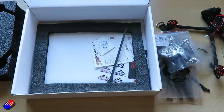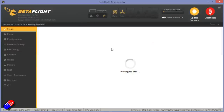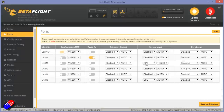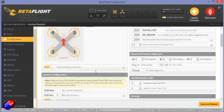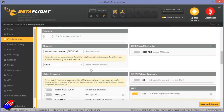Let me quickly go through the Betaflight setup. We'll click connect — there's something in the data flash, meaning it's been armed and tested before it shipped to me. In the ports, we have GPS enabled, ESC telemetry, and Tramp for the Zeus 800 milliwatt VTX at the back. Motor direction is reversed — be aware of that before you fit your props. D-Shot 600. Everything else looks pretty standard. 8K gyro and PID loop frequencies, but this is an F7-based processor so it's not even taxing that at all.